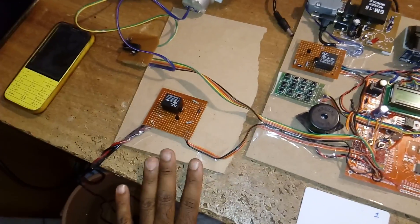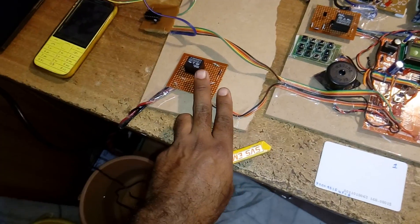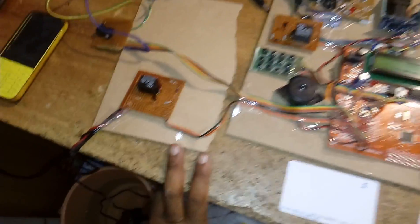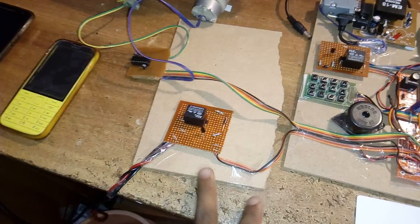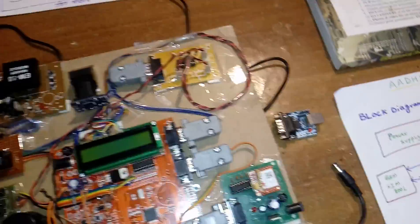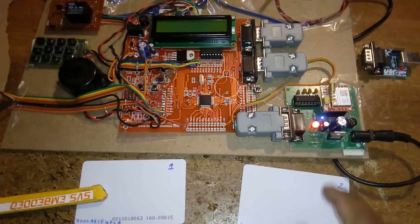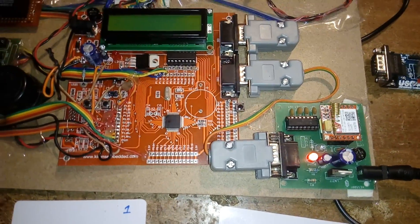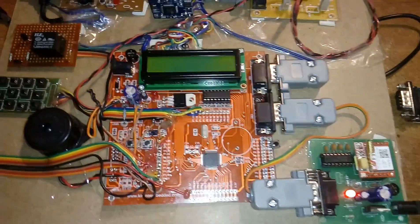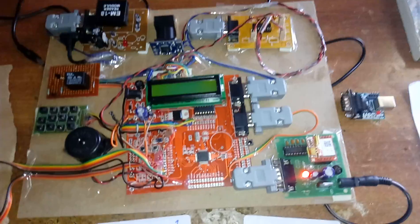For the motor (kerosene pump), we use an SPDT relay — single pole double throw. We are using an 18-watt cooler motor pump, switched on and off via the SPDT relay coil driven by a BC547 NPN transistor. Now we are powering up the GSM module. One LED is present — we first need to catch the GSM signal before proceeding with any operation.